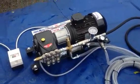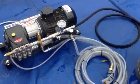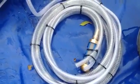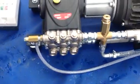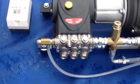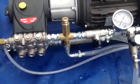Set up on a frame, and like I say the thermal overload switch — any problems it will automatically knock out on that system there. Set up with a suction tub filter and you've got your return pipes and so on. We've also put a safety valve in the head as well to protect it, so if it goes over 250 bar it will automatically knock off — if that bypass valve, balance valve knocks off, it will knock off.